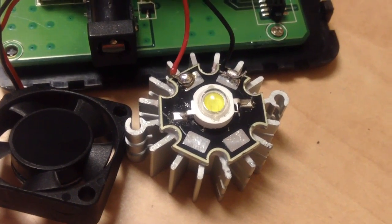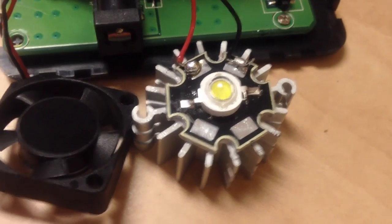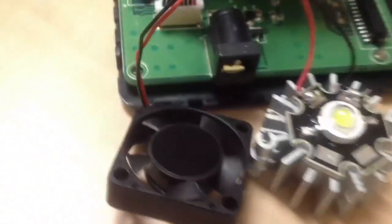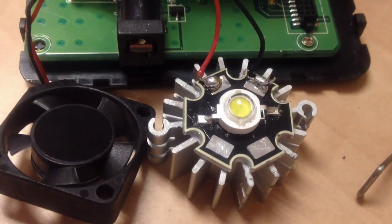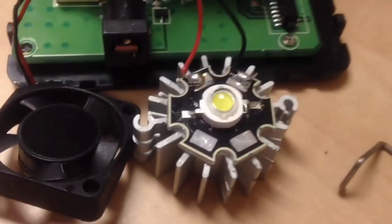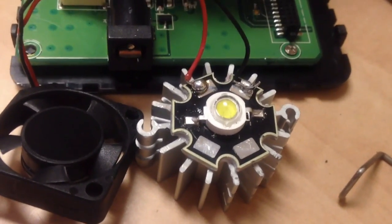This is the 200 lumen LED that I put in — not the greatest soldering job, but the projector did work and was a little brighter, just not bright enough. We're going to remove that LED and replace it with the 350 lumen LED using this heat sink compound from Radio Shack. It's an adhesive heat sink compound — the first time you remove the LED it's very sticky, almost the consistency of chewing gum, but I worked it a little with a flathead screwdriver and it came right off.